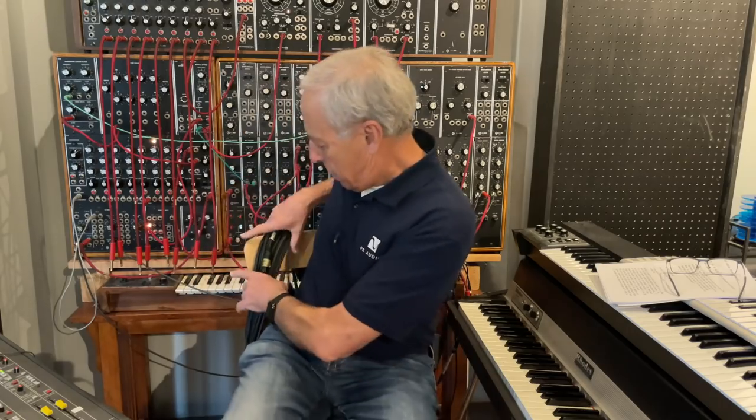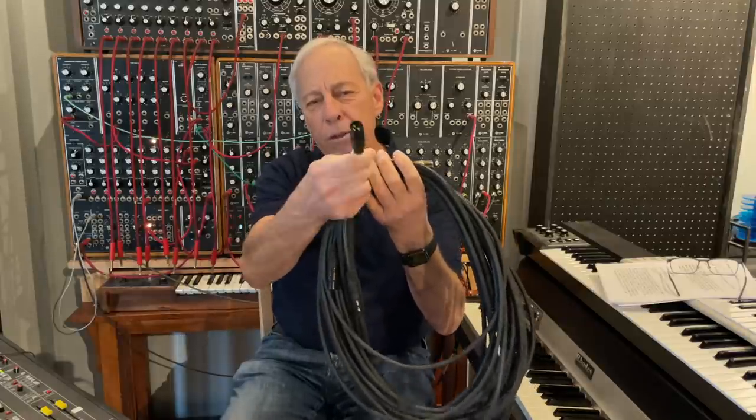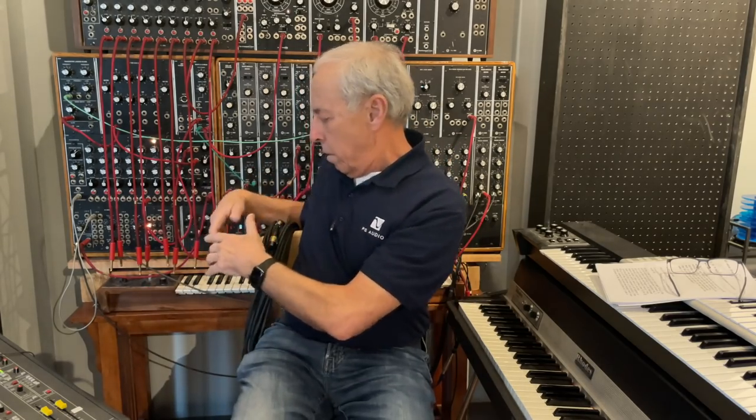Let's clear the cruft away and start with some basics. XLR cables on equipment that is designed properly is the best way to go. An XLR cable is a balanced cable and it uses something called common mode rejection to reject anything in common that comes in — like noise or hum — that comes in through the cable. Here's an XLR cable, and you can see at the end it has three conductors. Those three conductors — ground, plus, and minus — are the essence of a balanced signal.